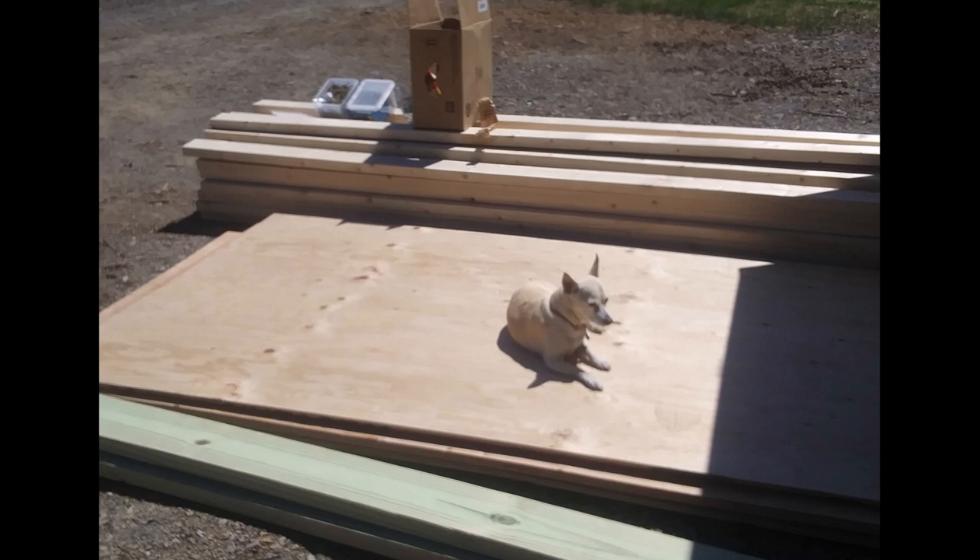You could use other variants of plywood. I wouldn't recommend something like OSB because there is a lot of moisture inside the coop, and we did paint ours with some really good paint. Our building is in 6-foot increments one way and 24 the other, 8 feet wide with 6-foot tall walls, so we got a large stack of 2x4 12s. We also got a lot of 3-inch Torx headed screws and some shorter inch-and-a-half Torx headed screws for the plywood. We really like ceramic coated Torx headed screws — you don't have that Phillips head slipping and stripping things out.